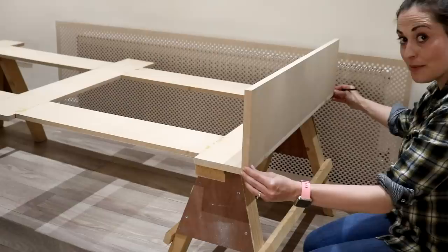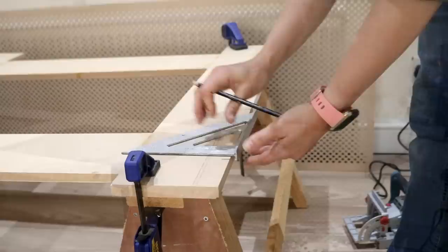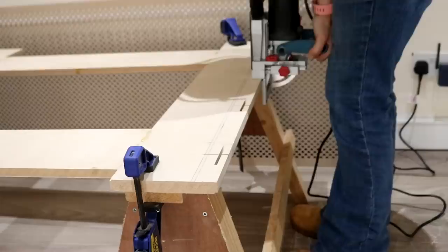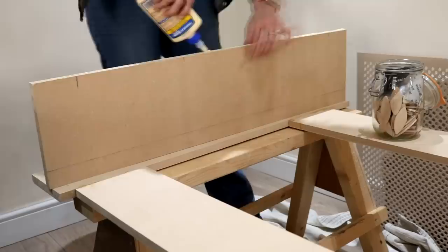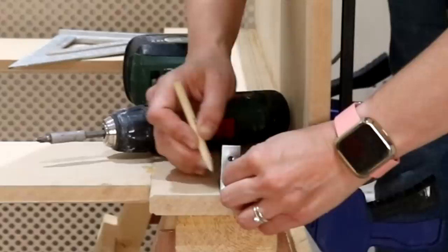For the sides I'm adding four biscuits. I had to make the pencil lines longer so I could actually see them and line it up properly. I used my speed square to get perfect right angles while I clamped them and left them to set. Another tip from Rob's video is the angle brackets — you could also use dowel pins instead, as featured in Average Joe's Joinery's version. I'll leave a link to that video. So I'm pre-drilling holes and attaching them with screws.